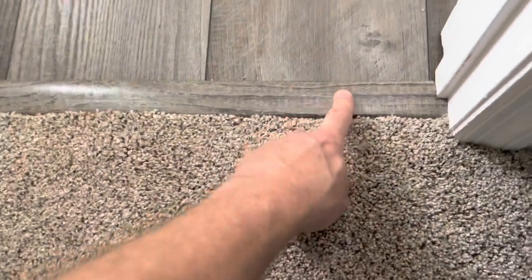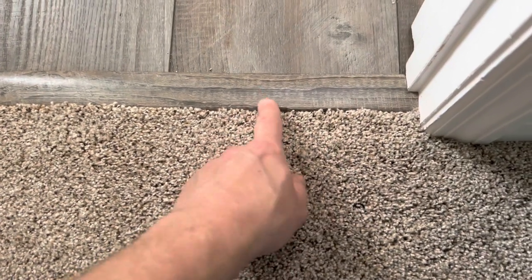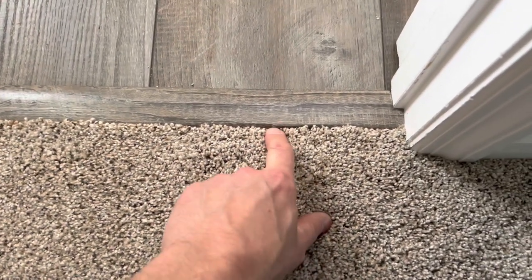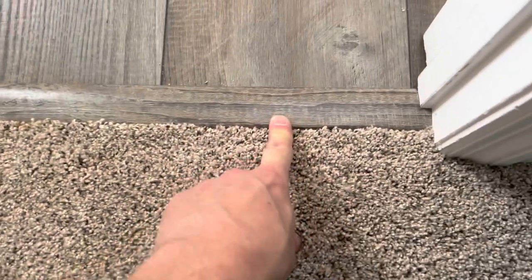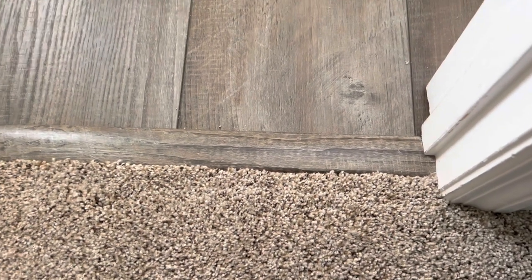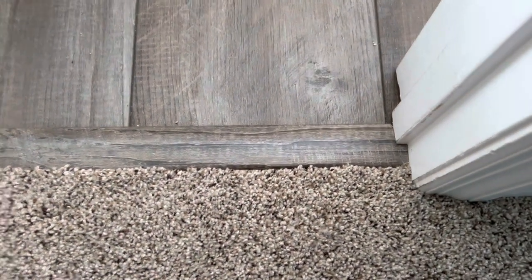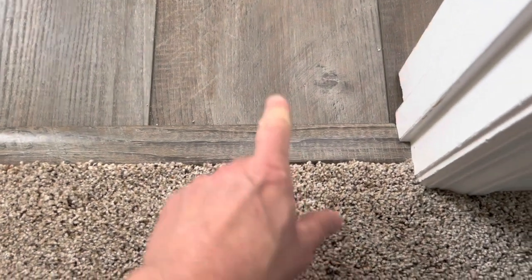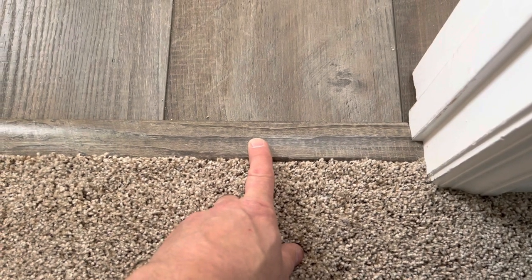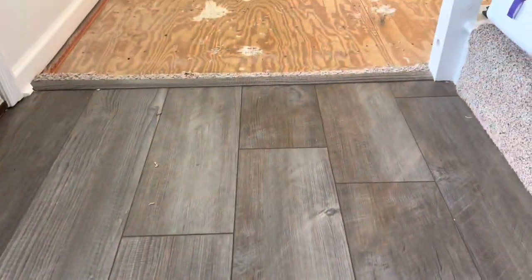This is laminate. Anytime you pull up these things right here, it busts into pieces. So what I did, I just kind of pulled the carpet out carefully, left the tack strip under it so it's got some support. Put an extra row of tack strip right here and then just tucked it right back underneath that lip, so it's still got something solid there. There's a little bit of give, but with the tack strip there it's still solid enough. Typically you should not have a T-molding going to carpet, but that's what's there and I didn't have that transition — somebody else, some other company, did this. So I just worked with what we had to work with.